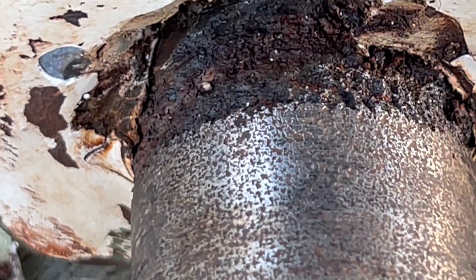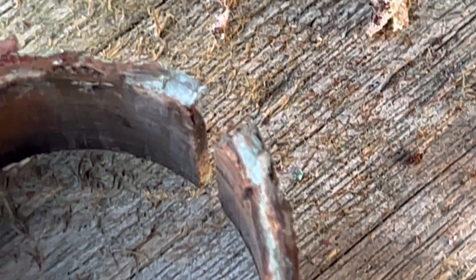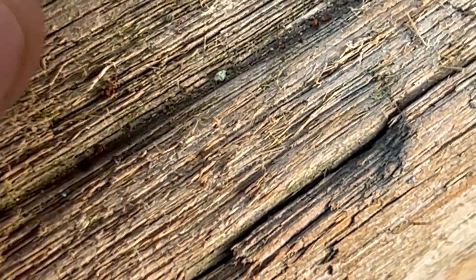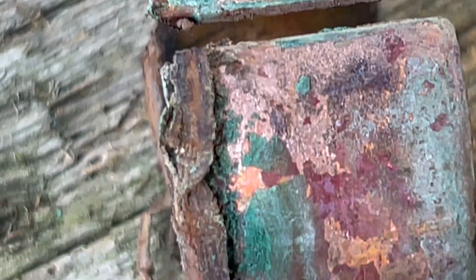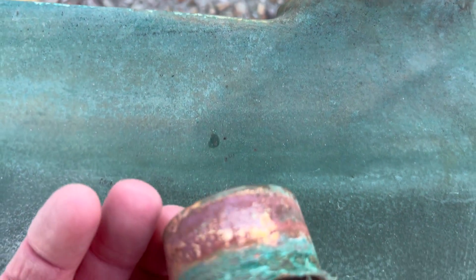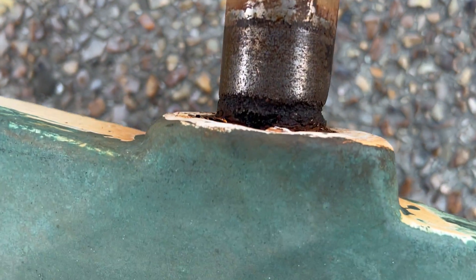As you can see, lots and lots of pitting — classic corrosion. There's the bush, and again the bush has had it. You can see the ring around the top where it's corroding, and in places it's actually gone completely. If we turn it over, look at the colour — that pink, that is electrolysis. Look at where the bearing is at the bottom end; you can see it's been eaten away completely. And where that meets the rudder post, just have a look at the profile of that post and what's been done to it — all that rubber seal, you can see it's been completely destroyed.